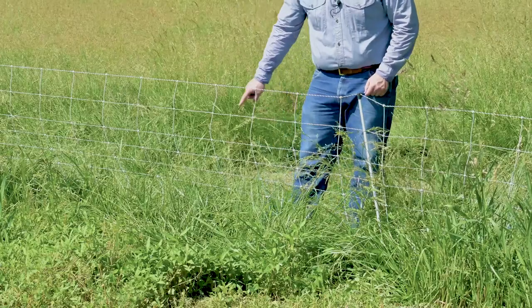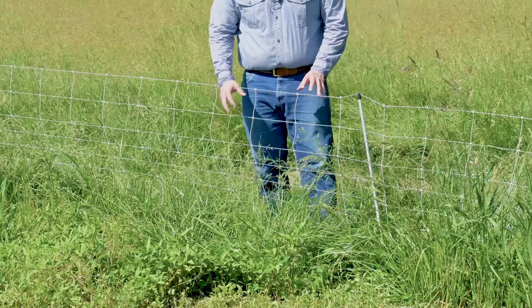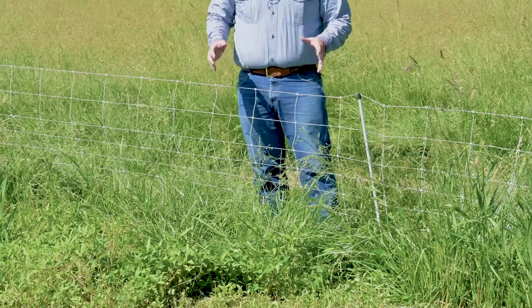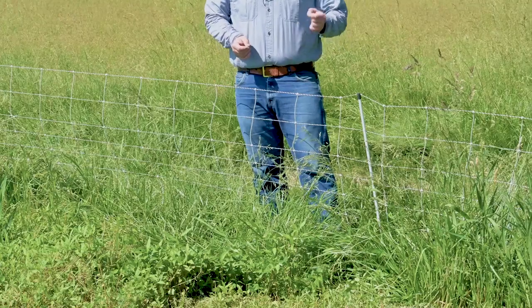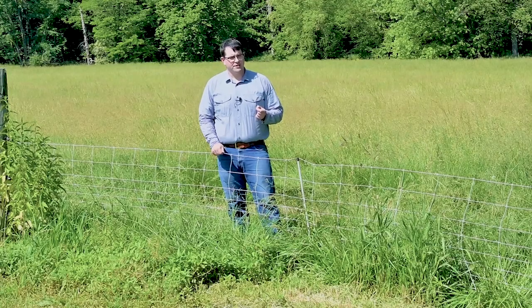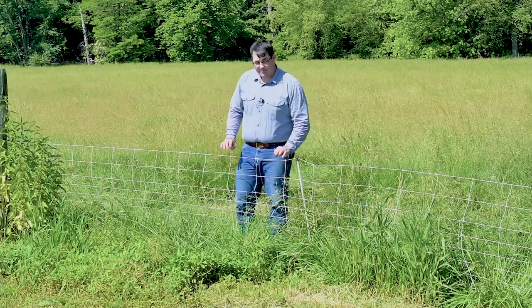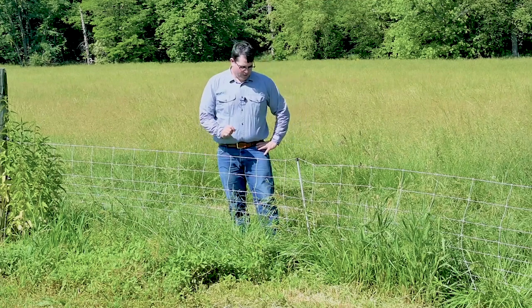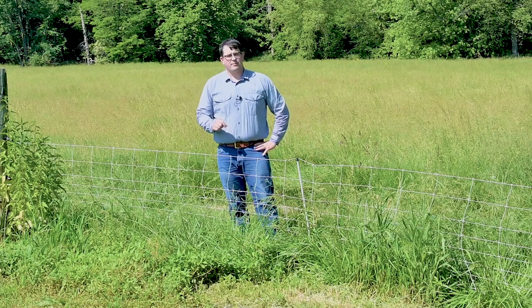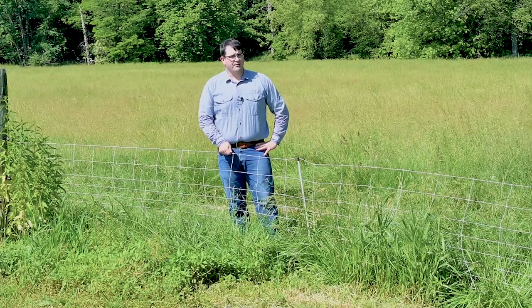My conductors are in contact with all the grass in front of me. The tall blades and the lower blades beneath are all in contact with conductors. Each blade of grass isn't that conductive, but it takes a little bit of energy from your fence — and as you can see, all those little bits add up to something big. So what we're going to do is either mow, trample, or weed whack this area to bring the grass contact down so it's not seeping energy from the fence.